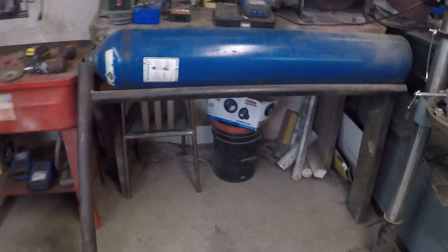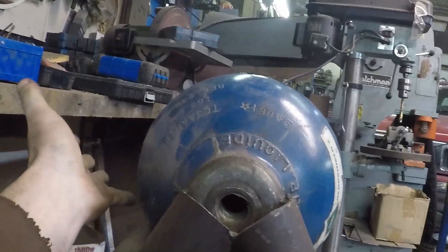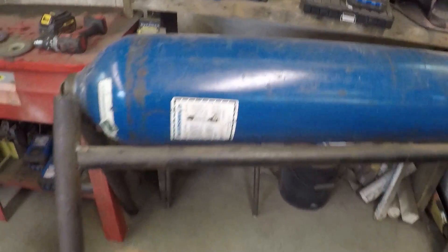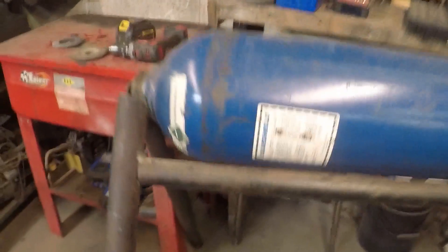The edges are all round, so if I'm beating on a panel and trying to make a curve in it, I just made different curves on the bench that I have something flat so I can just kind of hammer and try to make a hooked edge on something. This is nothing new, but I just wish I did a bigger — smaller tank. If I redo this thing, I'm going to use a smaller tank. But all it is is just some round pipes bent with a slot in it that you can fit your sheet metal through, so then you can bend and get this angle. Nothing I do needs this big of an angle.